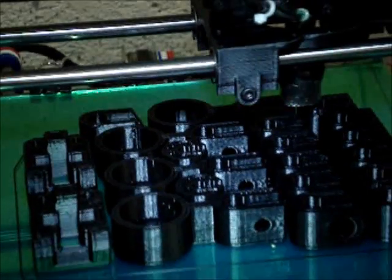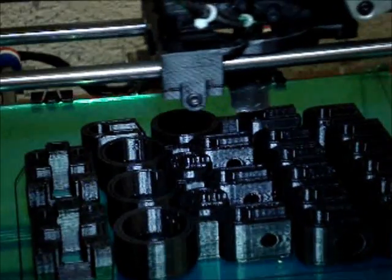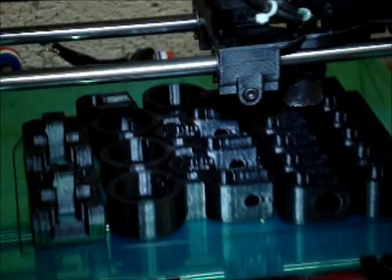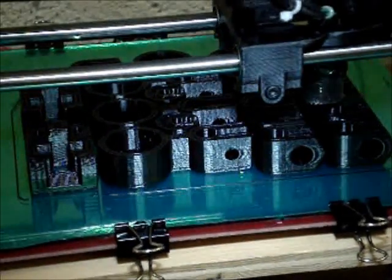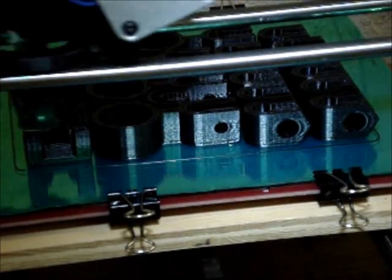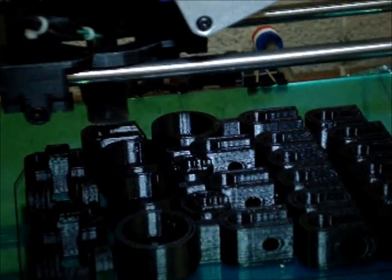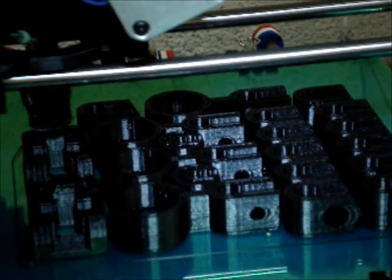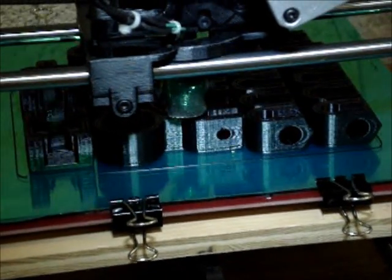That's because he didn't use retract — retract wasn't very stable and it took a little bit more time. If you look, this gear actually skips back every time it makes a jump of more than two millimeters — that's called retract. I retract at 1 millimeter for 3 millimeter filament. For 1.75 millimeter filament, I use about 1.5 millimeters of retract. It takes a little bit more retract because it's thinner filament. But all in all, if you use retract correctly, you get fantastic looking parts.